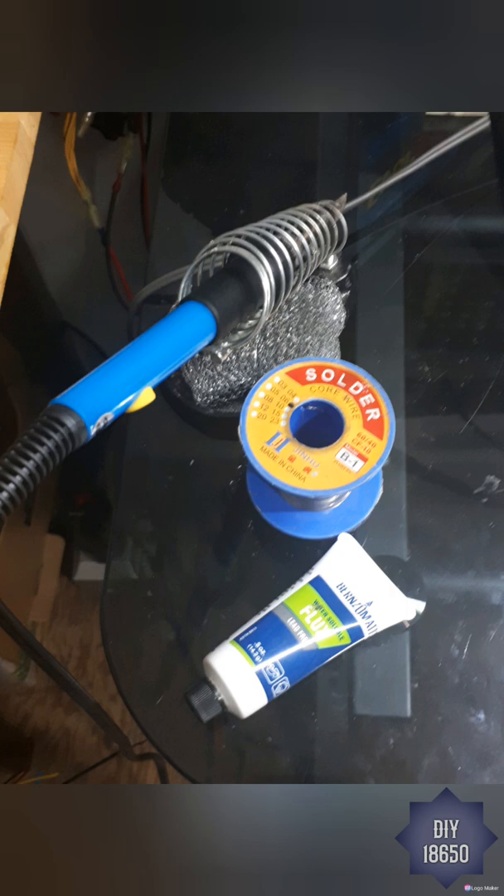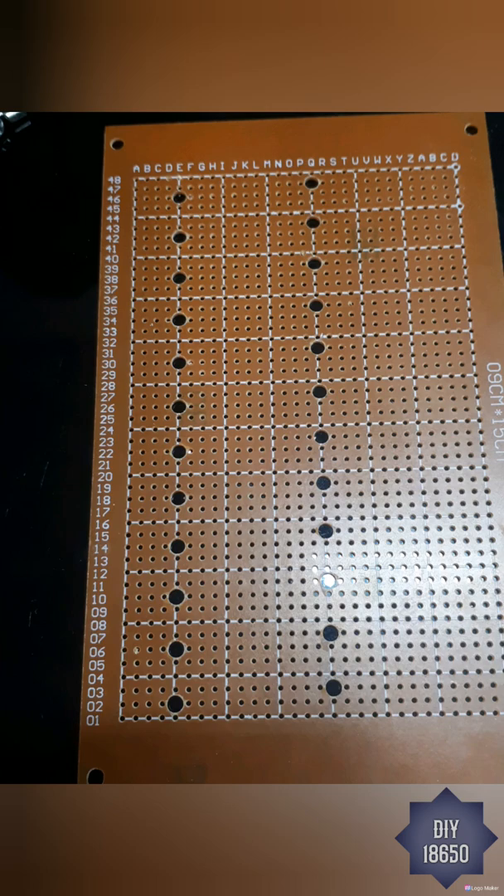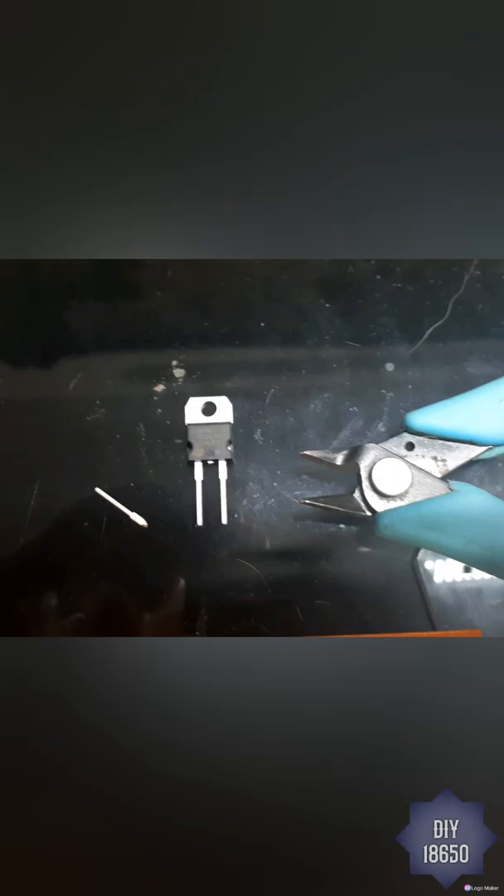When we get to the boards, on line E the second hole is drilled out with the biggest drill bit size, and you drill every fourth hole after that. Do the first pilot hole through the original holes, then drill them out to the bigger size. On line Q it starts with hole number three and every fourth hole after that — I'll put that written in the description. Clip off all the middle legs of the MOSFETs; we're going to use the back tabs as the drain instead of the legs.